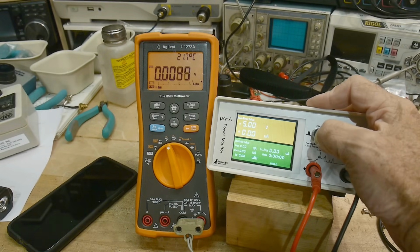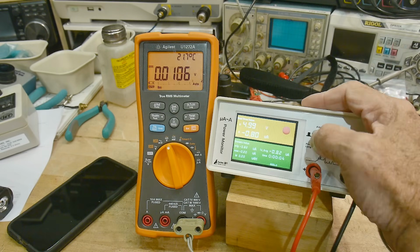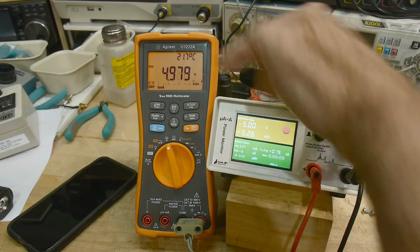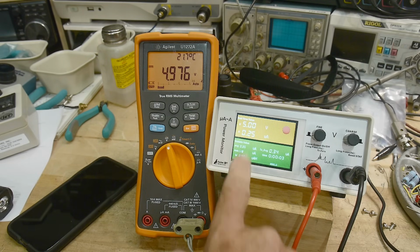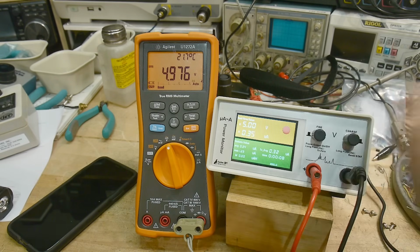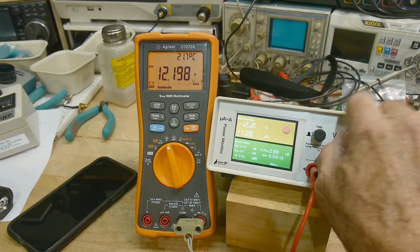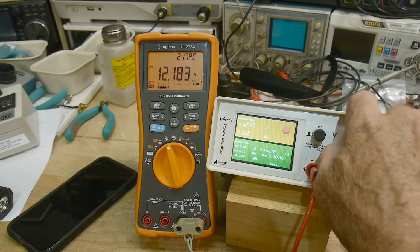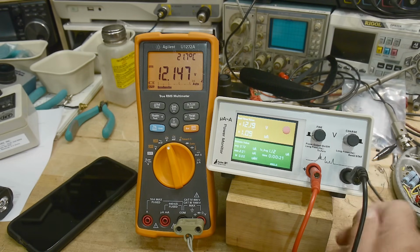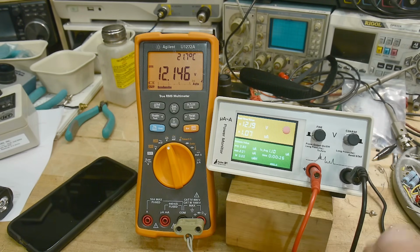All right, let's see what kind of volts this thing has available to it. See that red light comes on, we get no voltage on the output. You gotta push it a couple times and there we go. All right, so the voltage accuracy, 5 volts for 4.97. Okay, of course, let's ramp it up. How many volts can we get out of this thing? 12.2. Okay, 26 volts coming in, 12.2 coming out. And it shows 1 microamp.